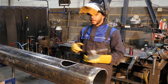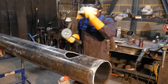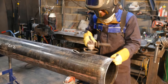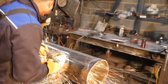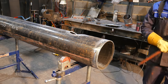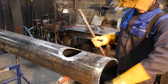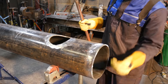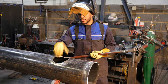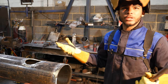I'm just going to clean up the outside where I'm going to weld and then clean up the inside to get rid of all of the swarf and nonsense inside. There are a few reasons why you would clean inside the pipe: one is to get rid of all of this swarf and nastiness — welding over this isn't good, it introduces porosity into your welds. Two, the burrs hanging inside messes with your flow rate. And three, this goes through into your strainers — you just don't want that.